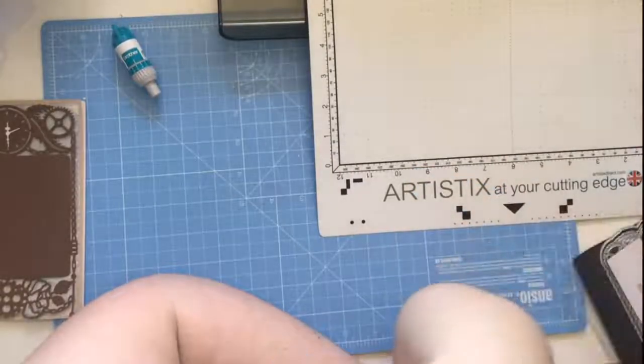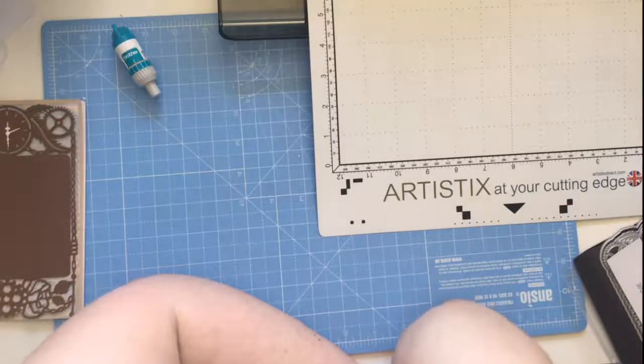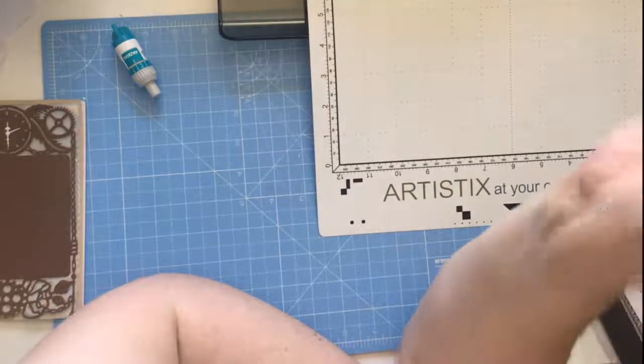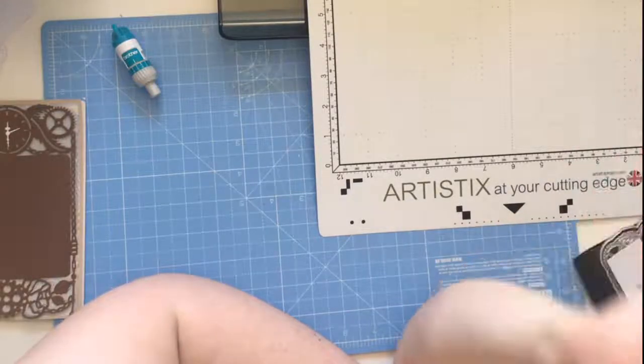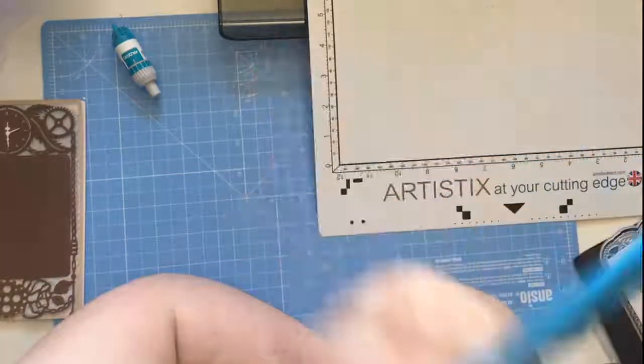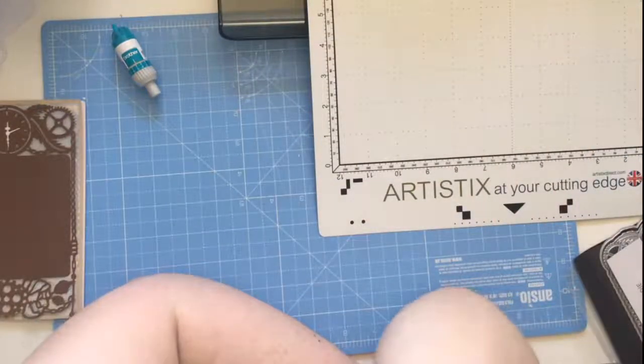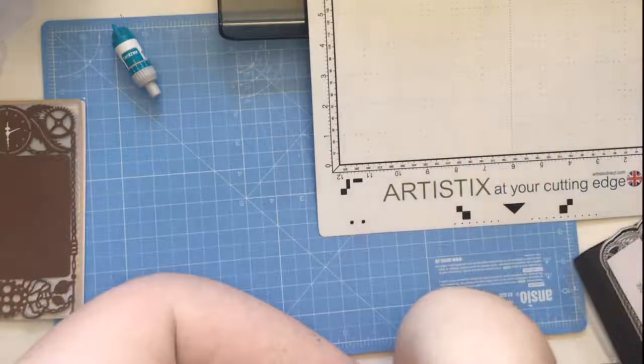Oh yeah, about drawing, just wondered why something that I drew today that I've drawn before took three times longer, and it changed from drawing lines to dotting it. As in a dashed line, you'd have to change that on. I know what it is. If you've sent it from desktop and you have no or a transparent stroke for your cut line, it changes it to a dot rather than a solid line. So that's usually what's gone wrong. It's lost its stroke if you haven't set it purposely to being a dotted line.